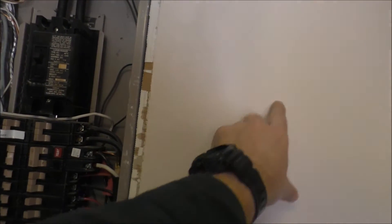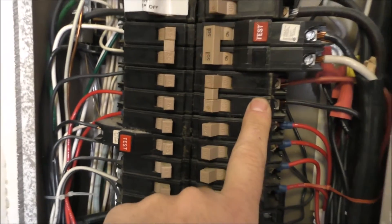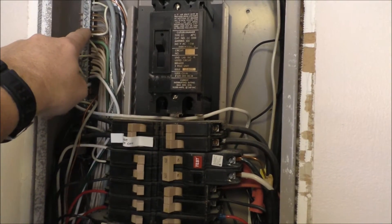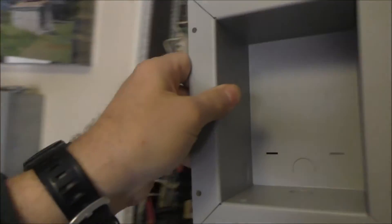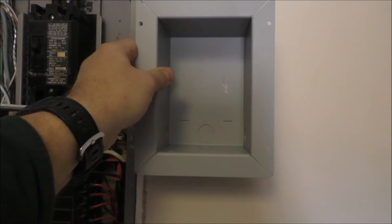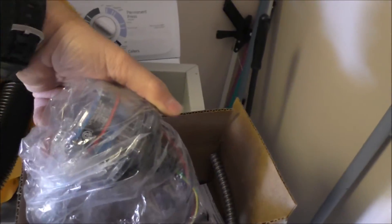Here's what we've got — we cut a hole right here in the wall, and it's going in and tying to the breaker right here. We also need to run a piece of ground over here. I'm going to do all the panels throughout the whole property — the whole house, outside in the shop, the solar shop, the whole nine yards. Here's the protection device, just like I have for all my solar equipment.